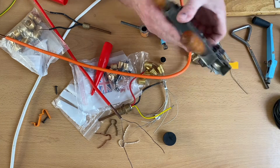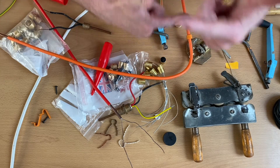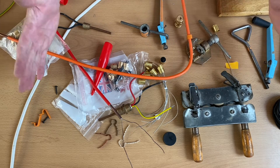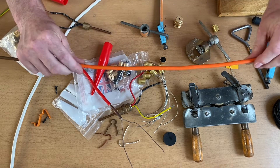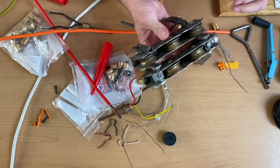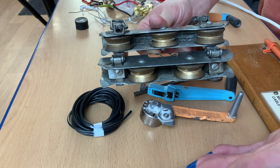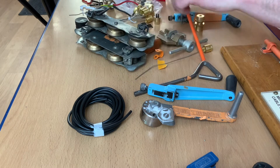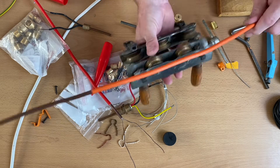The one I've been leaving on the table - hopefully you've spotted it - this is my straightening tool for MI. I recommend for mineral insulated cable that you wind it off the drum really neatly so it stays as straight and as flat as possible. But on site where you've pulled in loads and loads of cable, often it has little kinks in it. It's a series of wheels at which we run the cable over, and it should take out mild kinks. Really sharp bends it won't remove. You can also use a wooden block and a plastic headed hammer to tap these out.